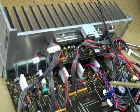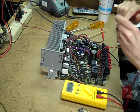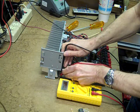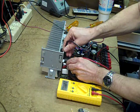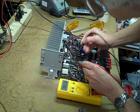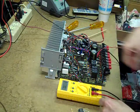You can check with an ohmmeter from emitter to collector on the output transistors and you would read a short between those two on the bad ones. If I take a DMM and check emitter to collector on the good channel, it's charging up through the power supply and heading toward infinite resistance. On the bad channel, it's shorted — probably shorted all the way around, although not always. With those being shorted in circuit, checking the emitter resistor might not be meaningful since they read a near short anyway, so I'll want to recheck that after removing the output transistors.